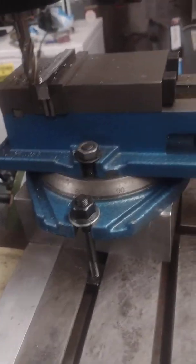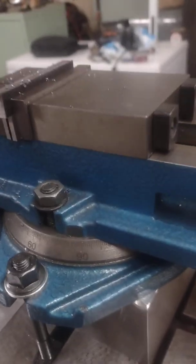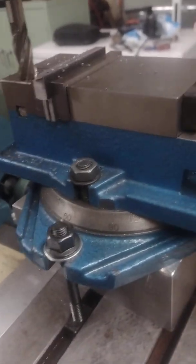I've been messing with this thing for months and months — years now — but it's getting almost done. I had to tear into this table because I had a wicked amount of backlash. What was happening was if I tried to run a pass and went from one direction to the other, when it dug in the whole table would jump — enough to break bits and gouge holes and all kinds of things.